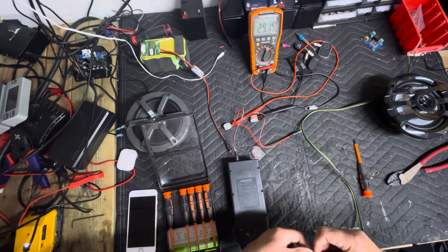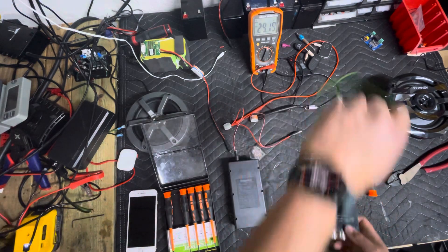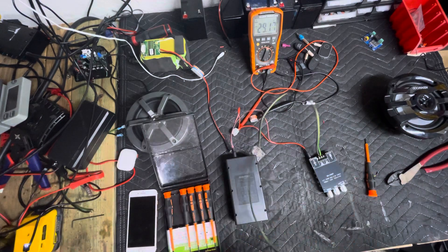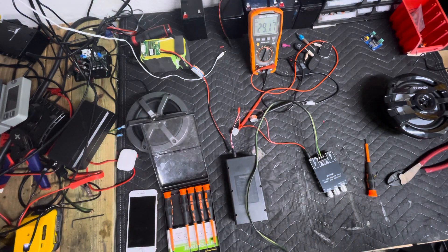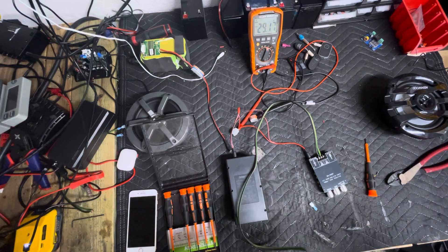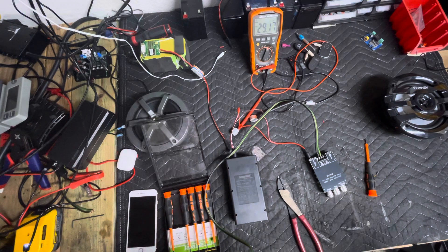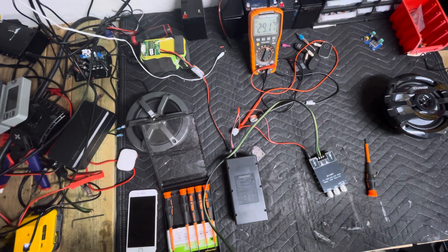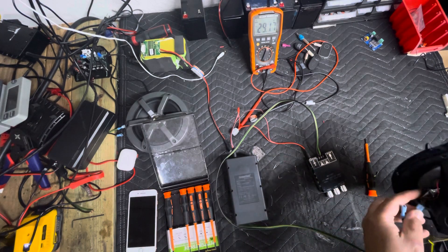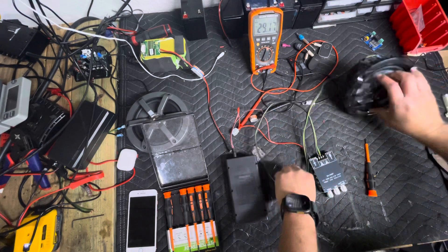Summing the channels doesn't give you any more power — just a heads up. I've done that video several times too. Alright, that's hooked up. Let's go ahead and plug in the amplifier and get some connector ends on for the speaker. We'll use this Kenwood that I've got — also got a JVC. Let's go ahead and connect this speaker. Positive, negative. Alright, that's set up.